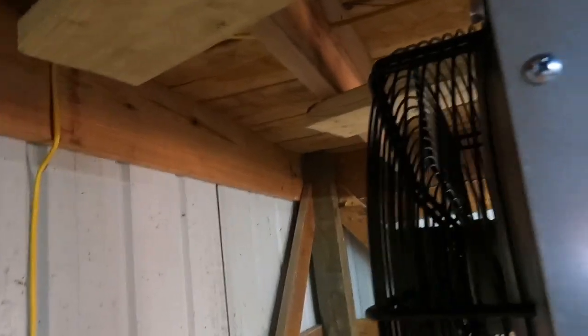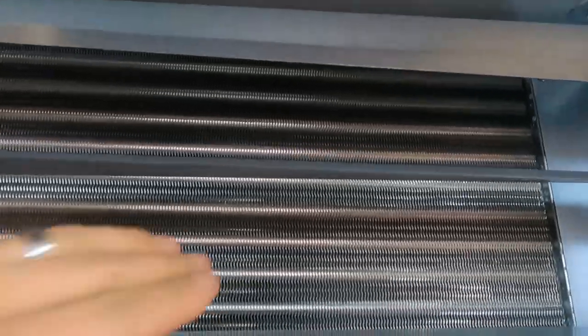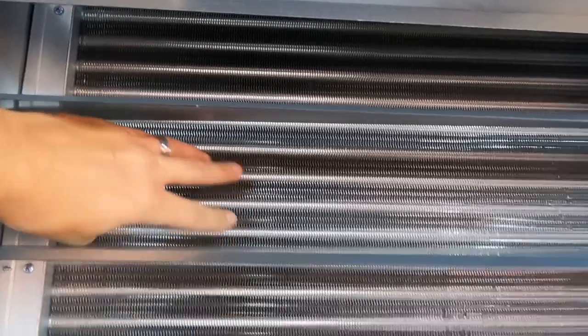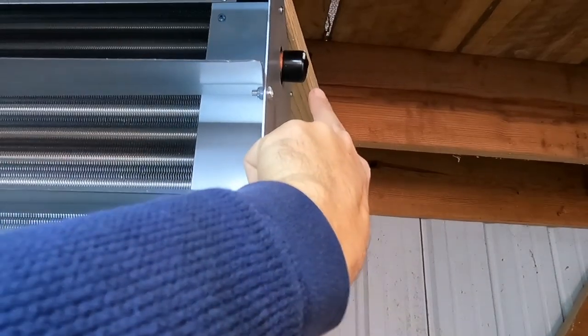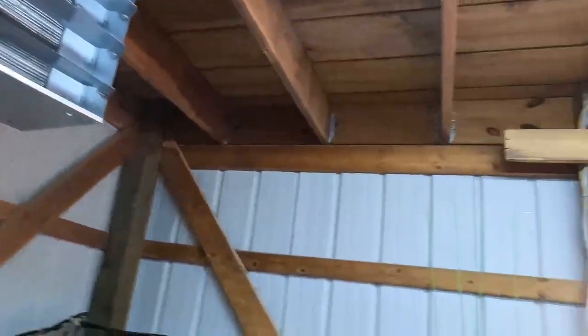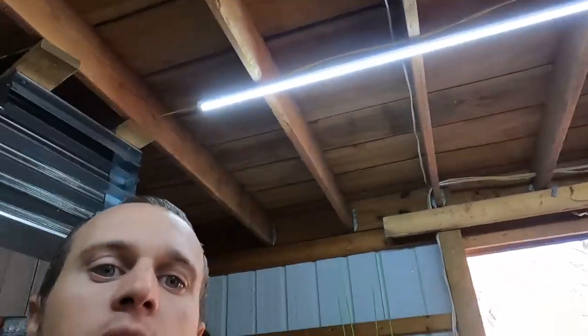This is just a steel box all the way around. You can see there's a fan on the back — it attaches to it — and then these louvers I can change to point the air in different directions. On the inside here, when you open it up, you can see there's a heat exchanger. On the sides here you can see I have my ports: there's a one-inch port here and a one-inch port there. We're going to connect our lines to it, it will get hot, and the fan will kick in on the back side and push warm air out.